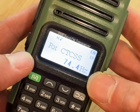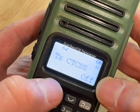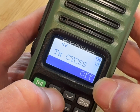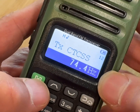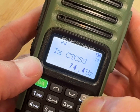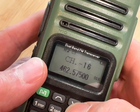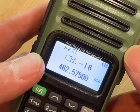We need to go up two steps to get to the second CTCSS code — this is the transmit or TX CTCSS. Hit the menu button to adjust it; we're currently in the off position. Scroll up to 74.4 — if you go past it you can go back down — then hit menu to confirm. To verify, hit the return button and you'll see channel 16 with 'CT' across the top, meaning it has a CTCSS code associated with that channel. Channel 16 is the Desert Hills Ward channel — it's now programmed so you can talk to your fellow ward members.